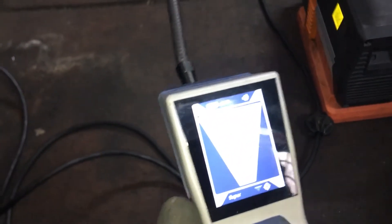My suspect area is right down in here — that is my go-to area. But it's not leaking right now. Let's put this in sensitive mode. I'm on the most sensitive mode right now. This is still my suspect area. I can't hold this camera and do a proper check — it's going to take a long time — so I'm going to try to find the leak first instead of holding the camera, and then zero you back in on it. Let's do the obvious one — let's go to the evaporator.